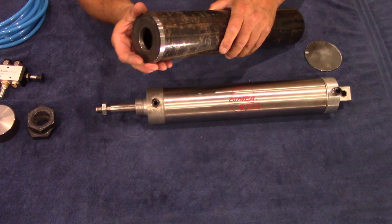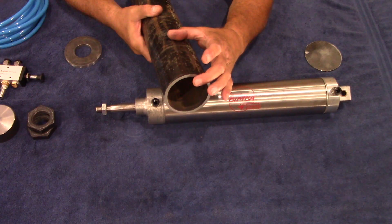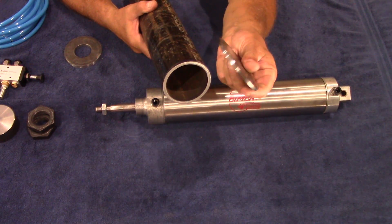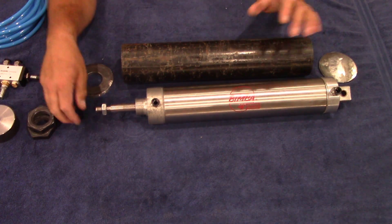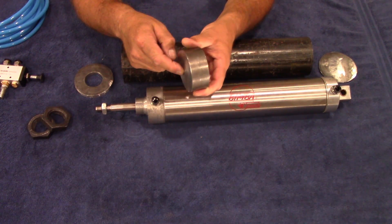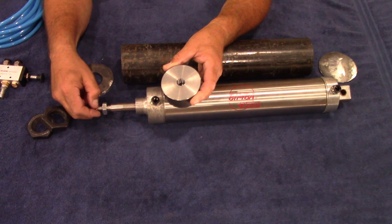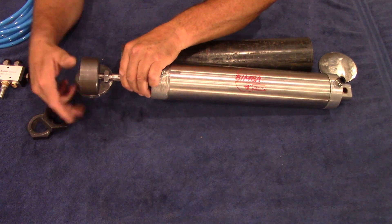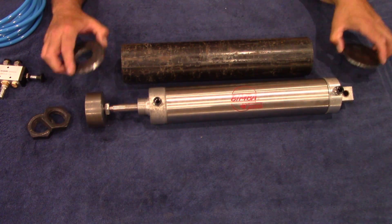The other end is where the cans get crushed. You'll have an exhaust port and then an end cap — this is a piece of quarter-inch plate that gets welded on. You're going to need some type of puck or crushing piece. This is a piece of three-inch by inch-and-a-quarter stock, tapped to five-eighths 18, because that's what the threads are on the end of the ram, and it threads right onto it. That's about it for the cylinder and the crushing tube.